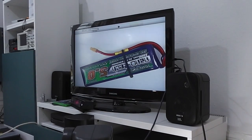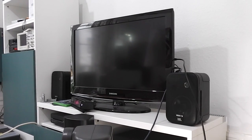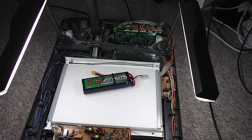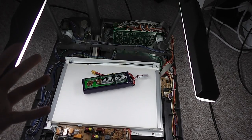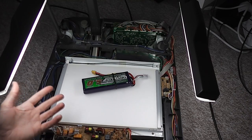And so that's the colour view. Switch over to black and white, nothing. But it hasn't lost signal. In other modes, when the camera wasn't working initially, oh wait, no, there it has. Okay, so I think there's something going on with maybe another functionality of the camera. Rather than switching over to black and white in post-processing, it's actually using a black and white function on the camera, and it's possible that the camera module fitted in this case simply doesn't support that, and it's switching into an unsupported mode.